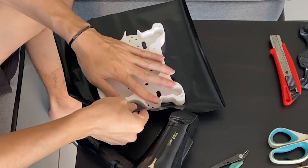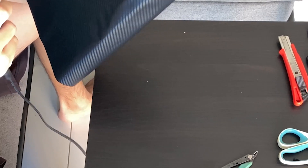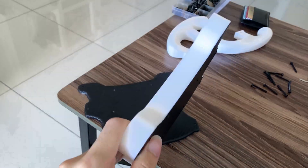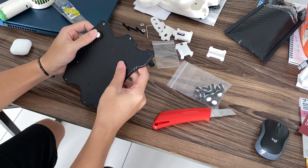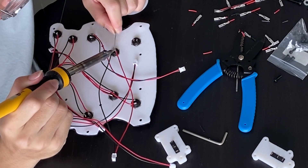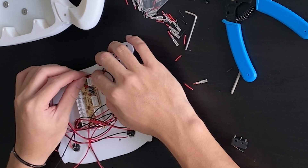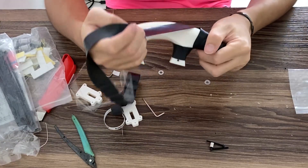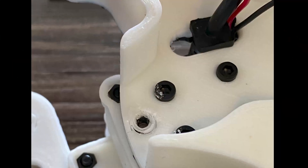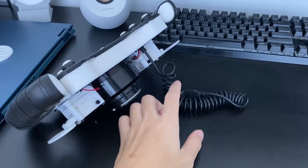Wrapping the body pieces with vinyl was much harder than I expected, given the large radius curves, and the care I had to take with the heat gun — or hair dryer in this case — as to not soften the PLA. In the final version, I just gave up on it and stuck with a white look to match the Moza base. Fitting the buttons onto the faceplate was as easy as screwing them into place with the hex nuts. The only caution while soldering the wires was to keep the iron on them for very brief moments, because the heat was causing their plastic housing to soften. The USB controller wiring was also very simple, as this design had ample space to stuff all the cables in. Wrapping the grips with thin badminton grip tape made all the difference in feel when racing, especially in VR, giving the wheel a very solid feel. To neaten up the cabling, I tucked the stress relief through the small slot at the back and wrapped the wire around the post, using heat to give it a coiled look and keep them off my leg plane.